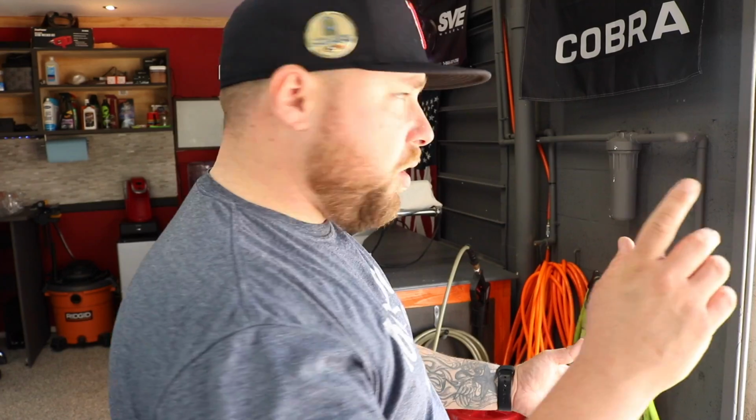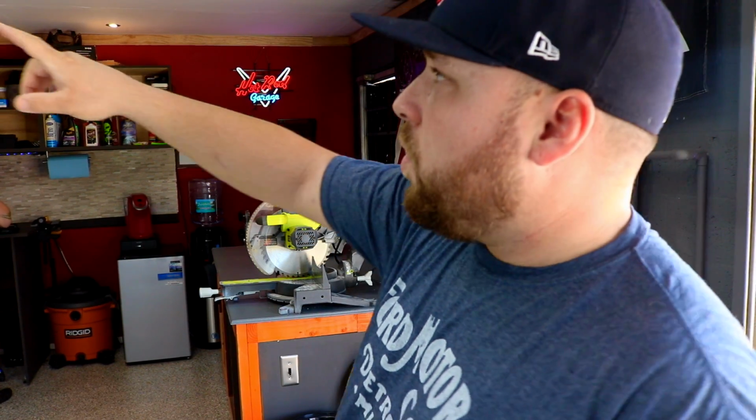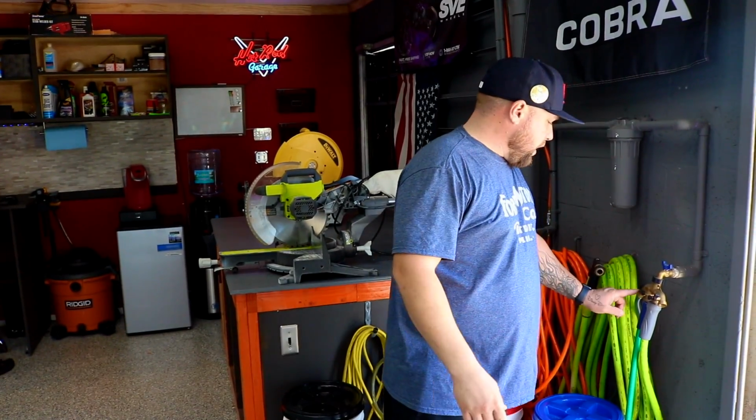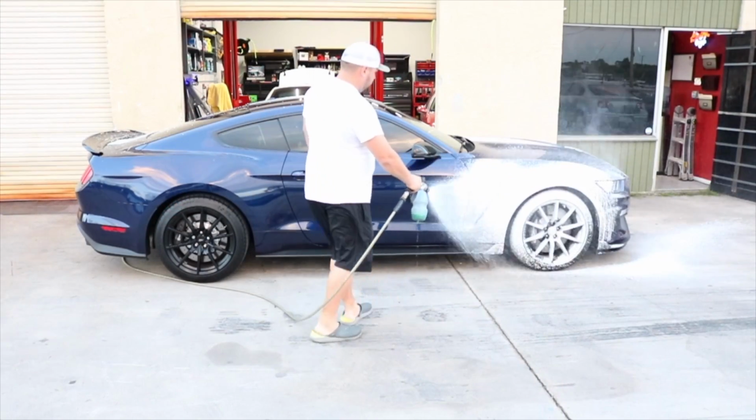When we got this place, it had nothing to the front. There's no power, no air, no nothing, no outlets, nothing. I tapped into the toilet water input, teed it, ran it up the wall, over the loft, down over, through a filter, and then now I have a hose bib with a 4-out. Called a plumber to come out to actually solder in 3/4-inch pipe the whole way, which changed the game when it came to water pressure and also the amount of water that was coming through. You couldn't really run a pressure washer off of it because it was starving it. It was just really nice to get that upgrade.